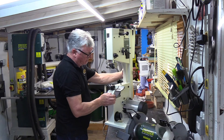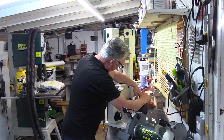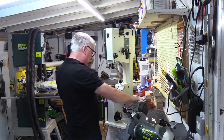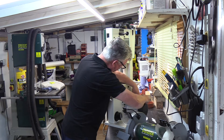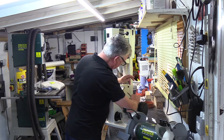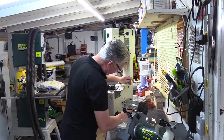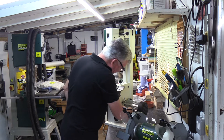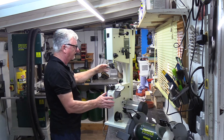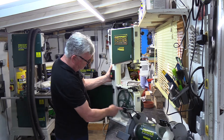Back around again, all I want to do is release that, then just drop it down on its own weight with just a little bit of flexing to the belt, and I can lock these up. You don't need that belt really tight — you still need a little bit of flexing there. Otherwise you can put extra strain on your motor and it burns out quicker. I've got a little bit of flex in there and it all spins nice and smoothly.